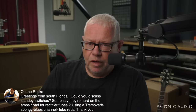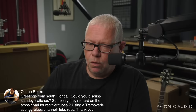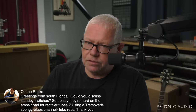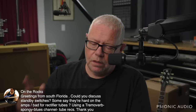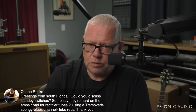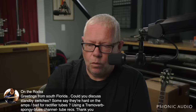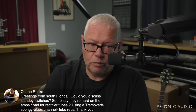But there are an awful lot of amps which have a standby for a marketing reason, because people think a quality amp has a standby, and it's often done poorly. So see that Dr. Z Route 66 video I did a couple weeks back, where I show you what the problem is and why it's not a problem in, say, a Super Reverb.